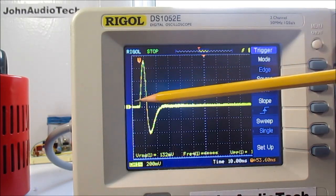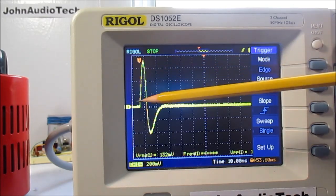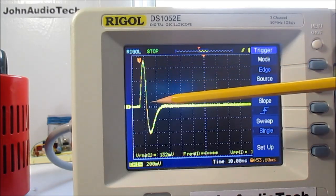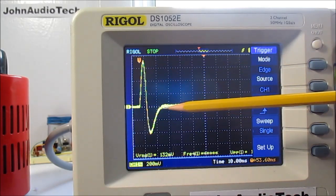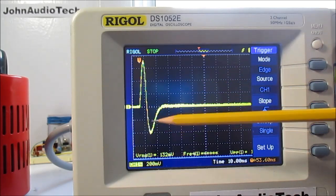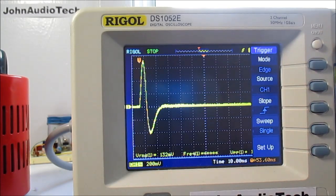There you go. So here's the initial pulse, and the pencil pushes the cone down, makes the waveform, and then look what happens here. It's damped out, so the return is much weaker, but look at this, there is no oscillation at all, just that one event, and it's pretty well damped. Even with a damping factor of 1, it pretty much has taken care of it.